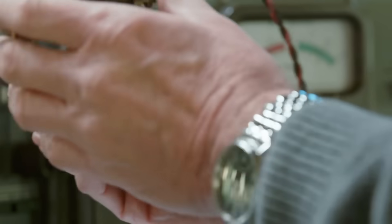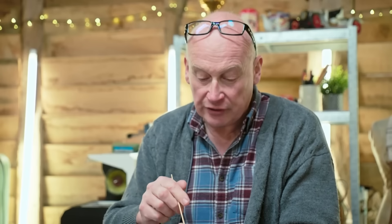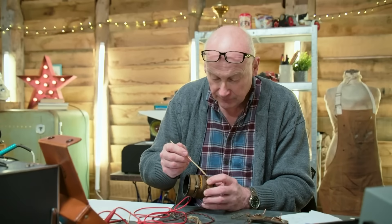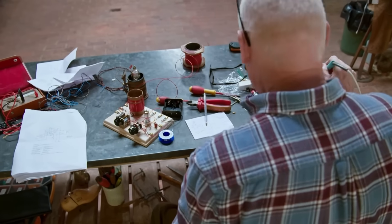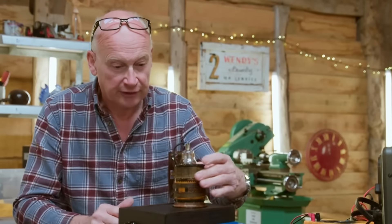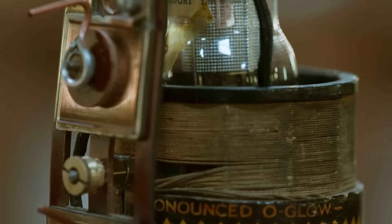But that's only one part of this. The coils have come very loose over age. This coil principally allows a signal from the radio waves to come in and allow it to go to the valve. If they're loosely wound, or literally in this case coming apart, then it won't be efficient. So I'm using a contact adhesive just to push this all back together nice and tight. We've got it all hidden nicely in there. That works a treat, and you can, of course, lift that off using that. It will be so nice that when Rosemary actually sees this and even hears it, that part of her father is still here today, still there working, which I find amazing.